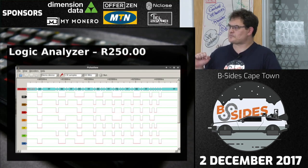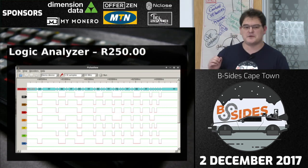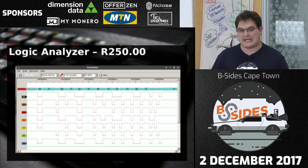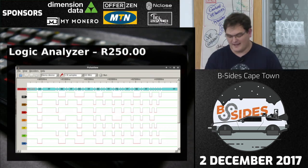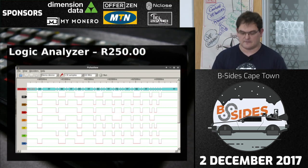I used mine constantly throughout this project — while trying to figure out why bits were being lost, this lets you see it clearly. It's also fully scriptable through Python so you can access all the data programmatically. The jump to a 16-channel analyzer goes through the roof price-wise. There are much better ones available — new Rigol oscilloscopes have logic analyzers built in — but for hobbyists like me, this cheap 8-channel version is very nice.